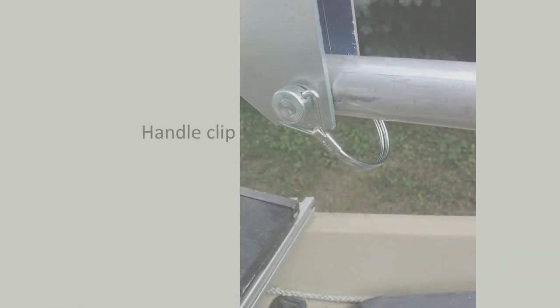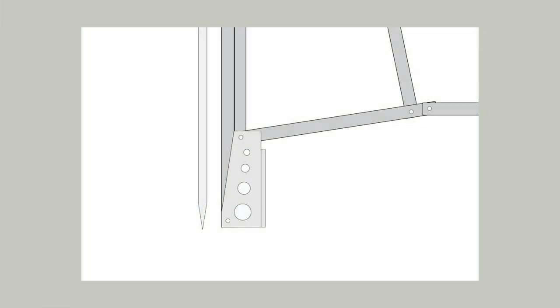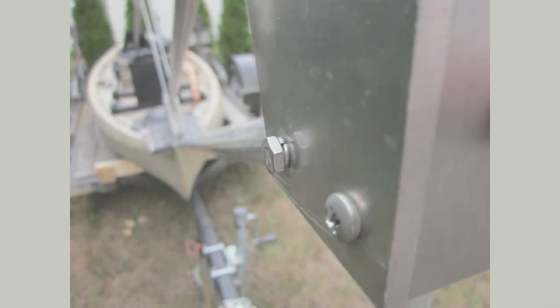Here are some ideas to make it better. The whole assembly was a little awkward when removed from the kayak. I made the handle removable by replacing the nut and bolt with a clip. If you mount yours to a transom, consider making the whole unit easily removable for transportation. Holes can be drilled to remove some of the material to lighten it up — you can do the same to the base. I noticed after using the unit several times that the nuts were loosening to the point of falling off, even though they had split washers to prevent that. I'll have to change the washers or use some kind of thread-locking compound to prevent this.